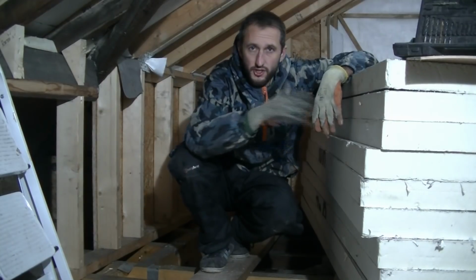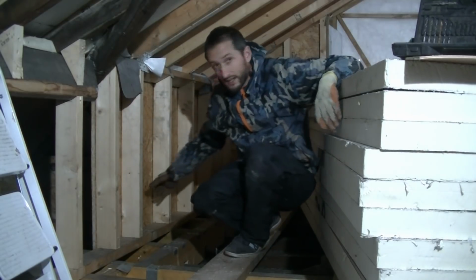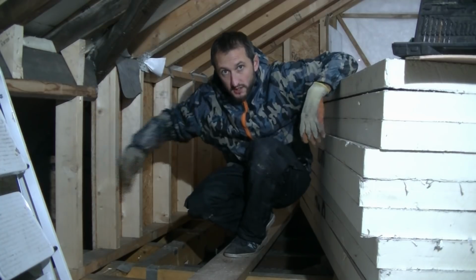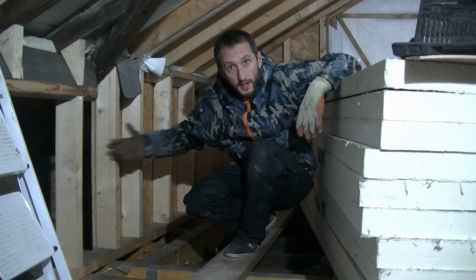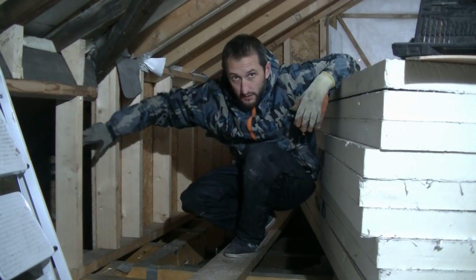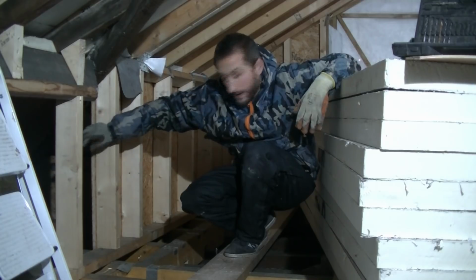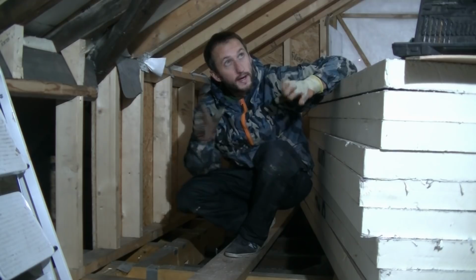So I've cleared this insulation to one side for a minute, and what I'm going to do is place a couple of junction boxes here eventually in this wall. It backs onto the cupboard so I can take some wiring down into the floor and off to one of my bedrooms. That's how I'm going to link the lighting circuit up. So I'm going to take a live from the final light in the house circuit, which I know is the far bedroom, bring it up to here, and then I'm going to place all my junction boxes down here.